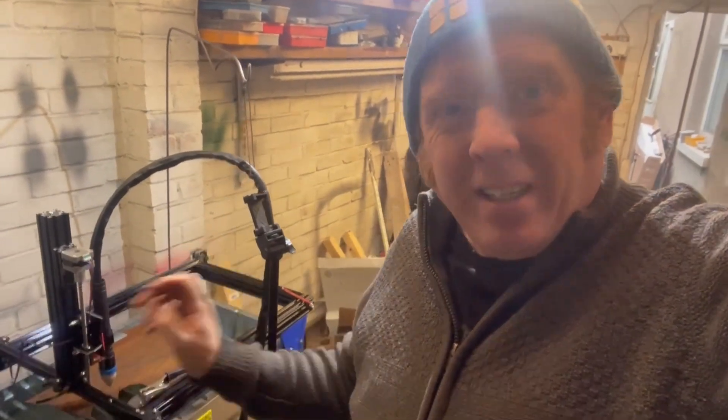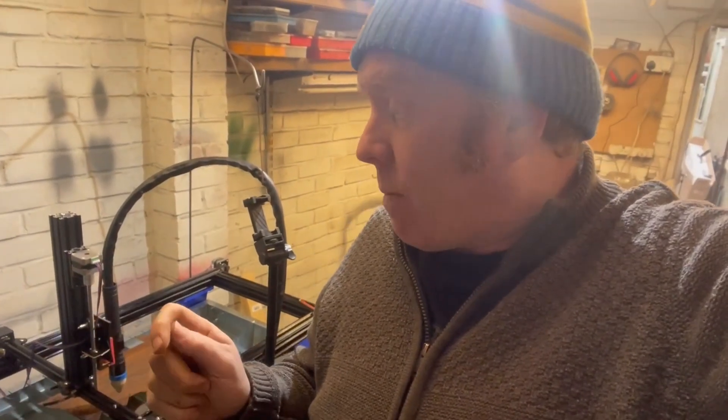What I've been doing in these last tests was using a CNC commander program, drawing a circle in that software, which got the thing moving and doing circles. What I couldn't get to work was the full Fusion 360 workflow - I use Fusion 360 to generate G-code, but when I put the G-code into CNC commander it didn't like it. I've now set up my own CNC plasma table tool in Fusion 360 and programmed it to generate the correct G-code. I found another tool that just sends the G-code straight to the machine and it works - so I can go straight from Fusion 360 all the way through without any intermediary steps.